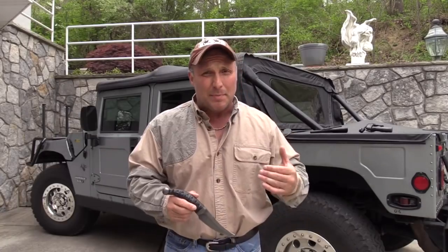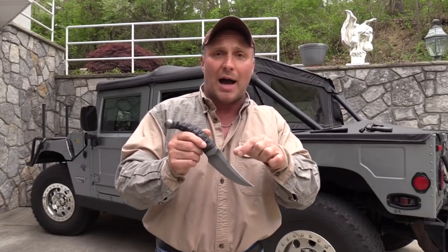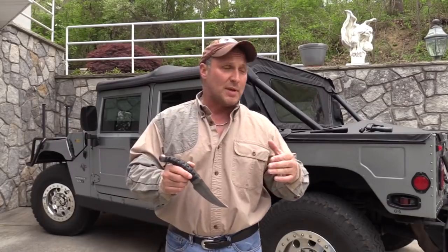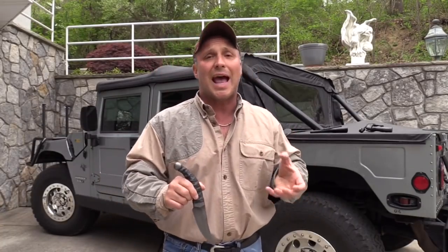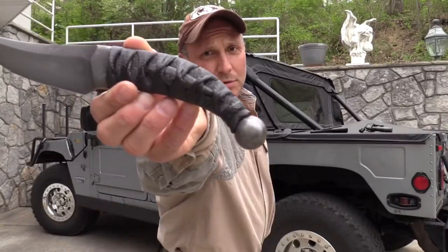What you get when people do cable Damascus that way is inclusions or small voids in the steel, where you're basically having little pockets in the steel that don't weld. David's method, which is being very thorough, of flipping and folding and flipping and folding and cutting into different pieces and putting back together, stacking and welding, really makes a blade that shows no inclusions.